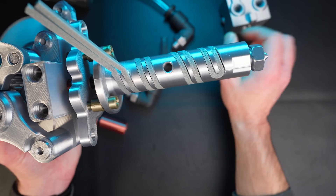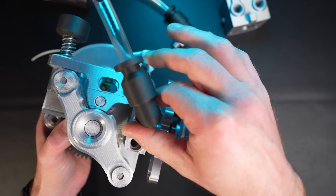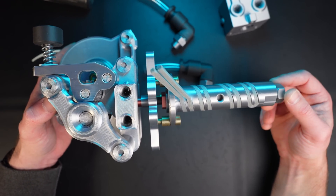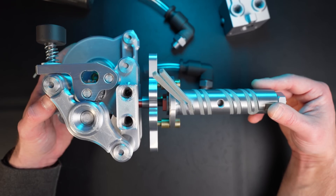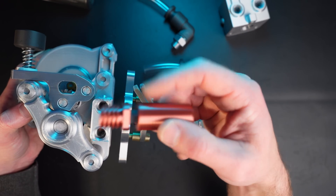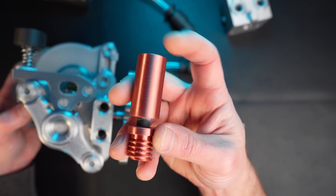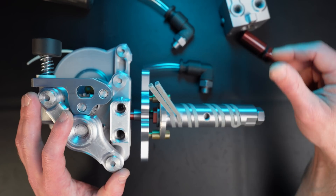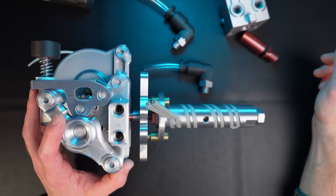Don't worry if you bought it — we're gonna be able to do an upgrade kit that's not very expensive. We're gonna use the same fittings that bolt right in front here. That is going to be an awesome setup. We're gonna test it with just the air cool version to see if there's enough cooling, but from our simulation it looks like that's gonna work just fine. This heat break — with that zirconia inside — is just phenomenal at keeping everything on the cold side cold. It's very effective, and it works super good.